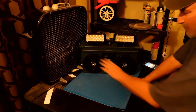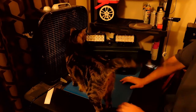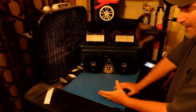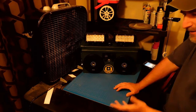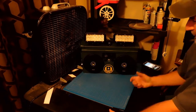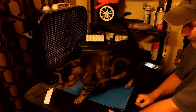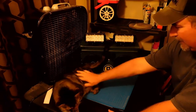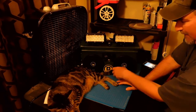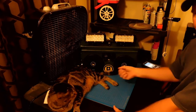It's going to be like a regular toolbox on top but with three drawers. I've watched some videos on how to remove the drawers, and what I'm going to do is order a piece of diamond plate — the kind you've seen on trucks — and put that sheet metal on the front with the speakers. I'm going to try something new: I've got that 100-watt amplifier with the control knobs, and I'm going to try to have those control knobs come through the sheet metal so we can tune the speakers — volume, bass, and everything — without having to open the box itself, because the toolbox is going to be pretty much sealed.